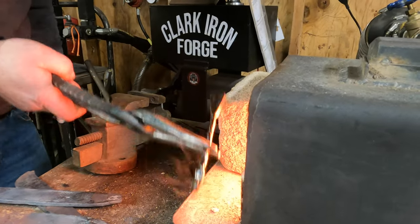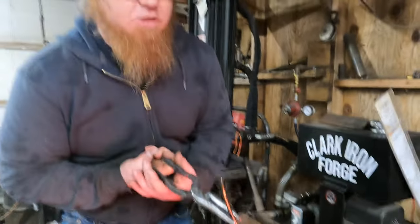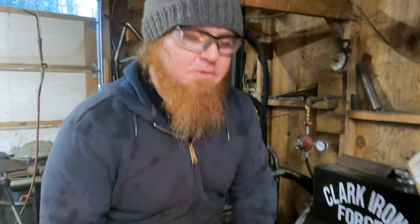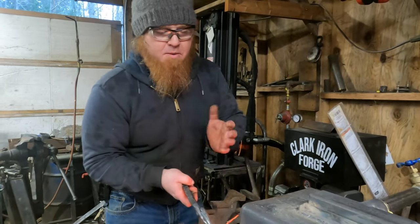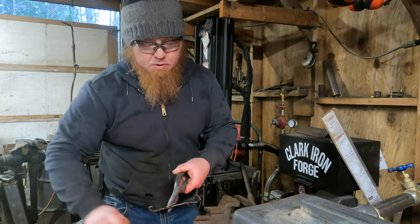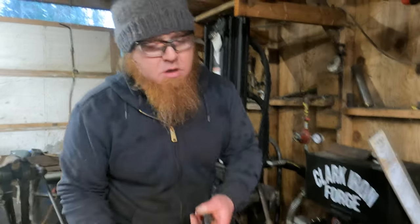I want to take a bunch of that moisture out. I'm looking to just get it to smoke — I don't want it to flame or bubble. The wax will make its own little shell around this as long as you keep the heat drying it out in an even method. This is probably one of the oldest blacksmith finishes there are, because beeswax was something available anywhere you went and was used for a lot of different things.